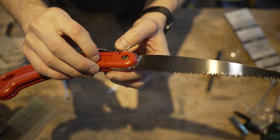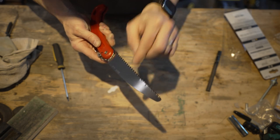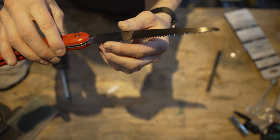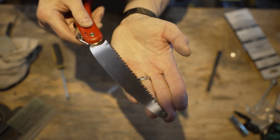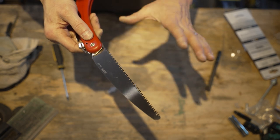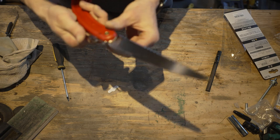There's a very dainty pin there — you can take the blade off. This is a very plasticky handle. The saw is very light — that's one positive. It does have medium teeth; a lot of these saws get real aggressive with their teeth, but you don't need that — in fact it makes it more difficult to cut hardwoods. The teeth are very sharp and very grippy. You can see how they were hardened with that darker edge — it's a shifting magnetic field that goes back and forth very rapidly, heats up the blade, and then right behind it is a jet of oil or water that instantly cools them. It's a pretty genius way to harden things.